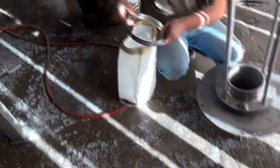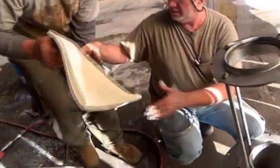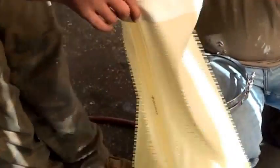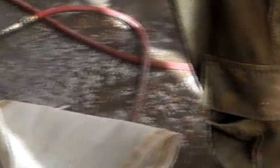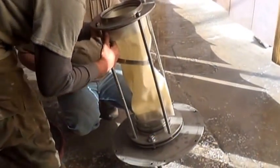We just done this sleeve. The one we're putting on here — what's the micron rating on that one? Twelve microns. And that's made out of PEEK. I can tell by this yellow color — that's acid-resistant fabric. It's very strong, though as you can see it's very clumsy. But it is very strong fabric. The white one is polyester, also a standard. PEEK costs twice as much as polyester. We supply mostly PEEK sleeves. They aren't available in 31 micron.